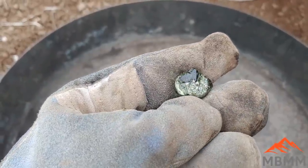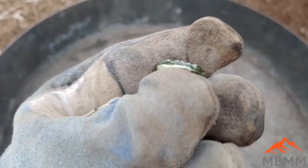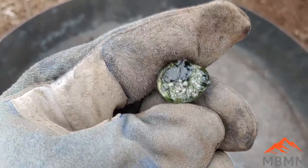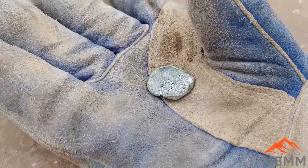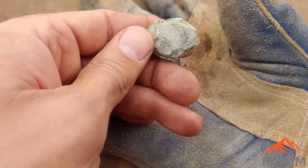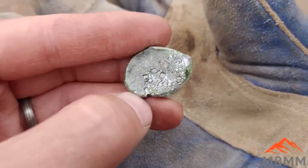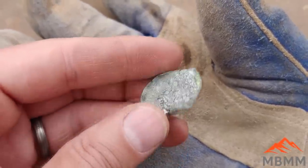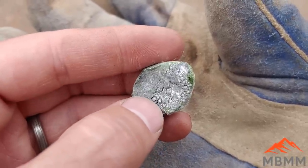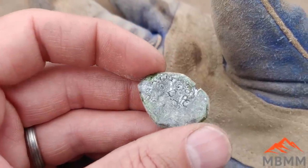That is what I was afraid of — it looks like we've got metal beads sitting on top of our lead. I wonder if that's metallic platinum just hanging out. It looks like the platinum doesn't dissolve in the lead very well. I pounded those metallic beads right into the lead. Those are probably pieces of platinum. What I'm going to do now is cupel this just to get rid of the lead — I'll probably recover all these little tiny platinum pieces left in the cupel. Then we'll do some research and come up with another solution.